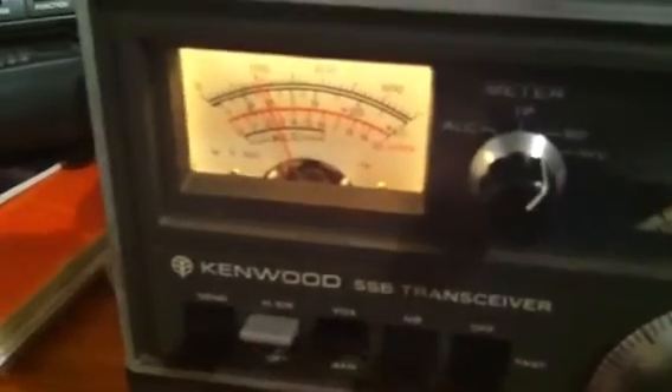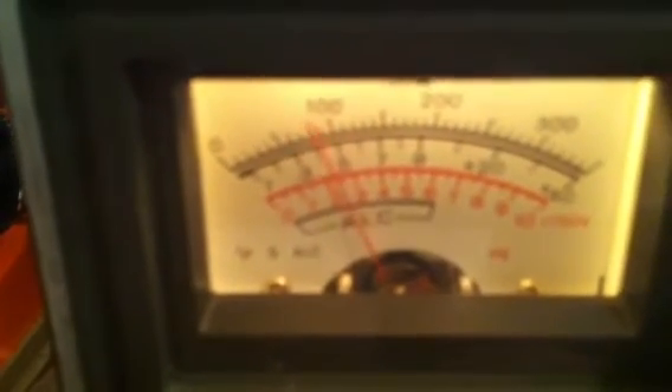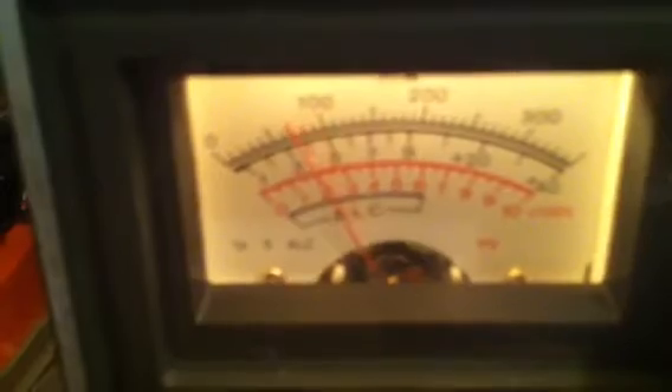The other thing I've adjusted — going across into sideband — when I go into talk, I've adjusted the bias so that sits right on 60mA, which is the correct setting. And as you can see, as I talk the meter is a little bit more sensitive and does move around a little bit more than it did in the past.